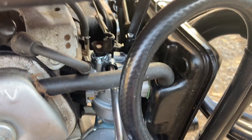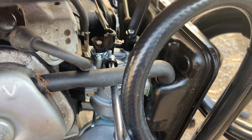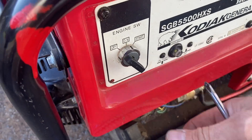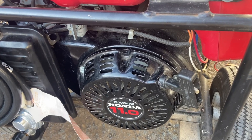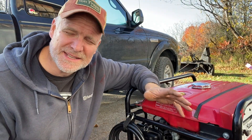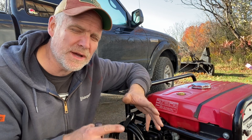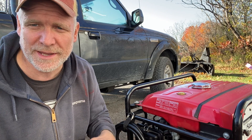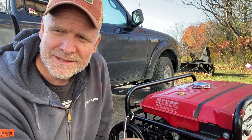If it's fluttering quite a bit, what you want to do is screw in this adjustment just till the flutter goes away — that stops the lever from moving too much. Your goal is to get it as close to 110V as possible, so it'll fluctuate between 110 and 111. I got the carburetor set up for gas — it's pretty simple but you just need to know how to do it and you need a meter to stabilize it to 110V. I feel comfortable it's running really good on gas, so we're going to try the propane.